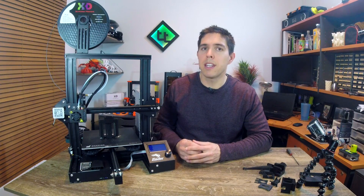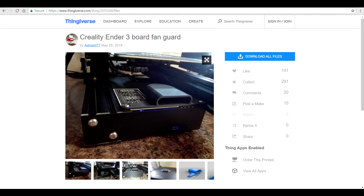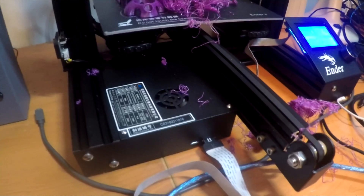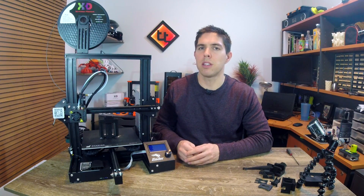The first mod was already fitted for my review, and that's this fan cover here. It's definitely a design flaw that by default the fan faces up just near the bed and especially where the nozzle primes. There's a fair chance that any loose bits of filament can fall down, jam the fan or foul the electronics. This is a pretty simple print and I urge you to make it your very first mod to keep your printer running as well as it can.